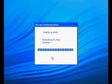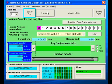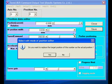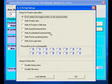The software will search for connected actuators and open up to the main screen. We will now home the actuator manually by clicking on the homing button. You will see that the jog run bar becomes available for manual control of the actuator. Click the Position Data Save window button and answer no to the teaching question. We can disable this question using the option menu as shown.